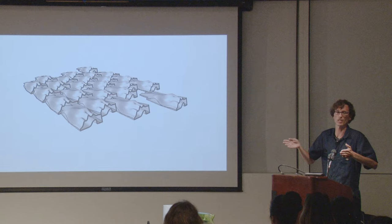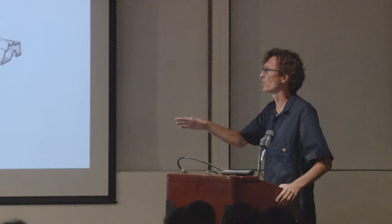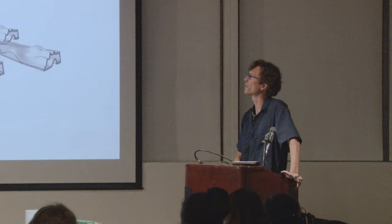Often with shaping a surfboard, you start with just a foam blank. It's more or less the shape of your surfboard, and then you shape it by hand, right? So in here, with these plaster molds, it's kind of similar. You start with a plaster blank that's more or less the size that you want, and then you send it to the digital mill, which starts to carve that geometry away based on whatever you have in your digital modeling software.